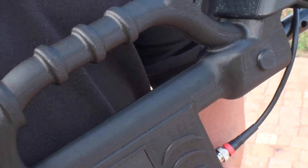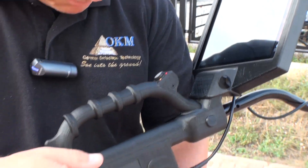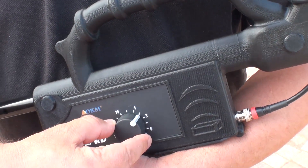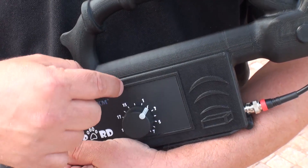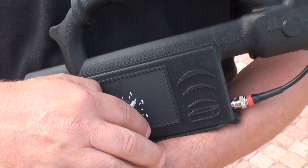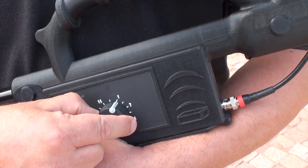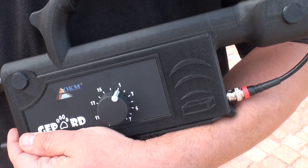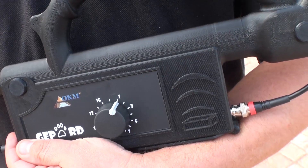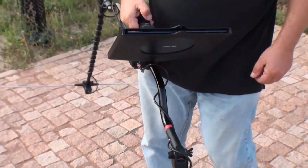As I check the depth, my one reading at 3.8 meters was my middle mark. By changing the knob to position 1 or 2, I will be able to better check depth for a more accurate result in this particular soil. If I was at setting 3, by going down to 1 I should just see the top of the anomaly, which gives a much more accurate depth reading because the lines will be closer together. So I'm going to do one more scan over the area.